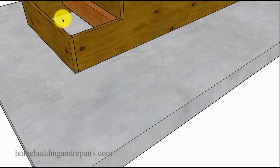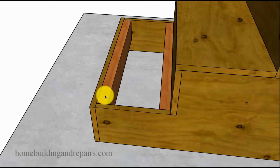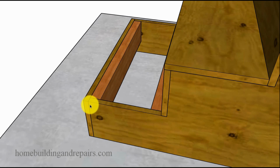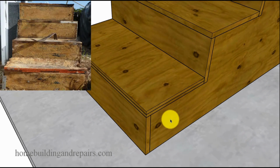And I also think that the same situation can occur on any lumber that's vertical. If you have lumber touching lumber, moisture gets in between it, it's trapped, it has no place to go, then it's going to absorb into the lumber. Pretty soon you get enough moisture in the lumber and you're going to be replacing the products.